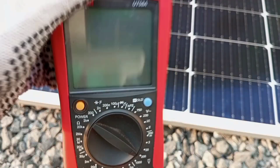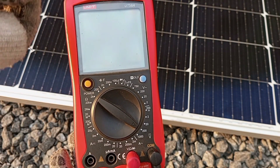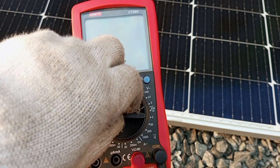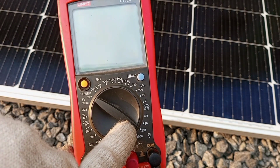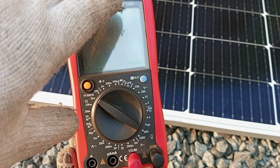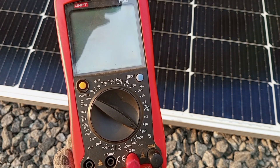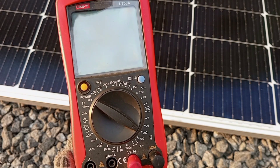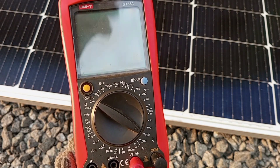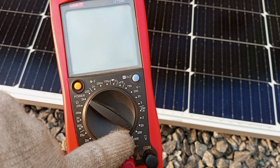To be able to do that perfectly, first you must bear in mind that it is DC voltage that we are measuring. So first of all you will have to regulate the meter to the appropriate voltage value. From the name plate or the information about the panel, it's supposed to give an output voltage of 41.33 volts. So the best value to choose here for the measurement is 200 volts DC.